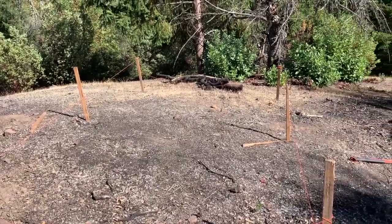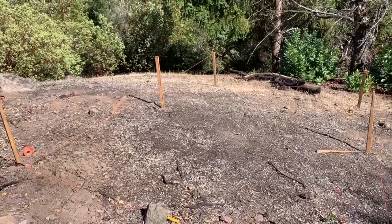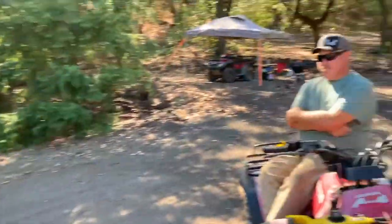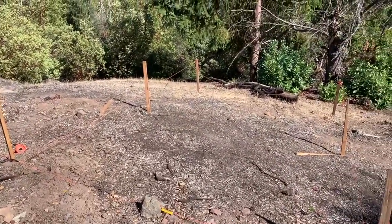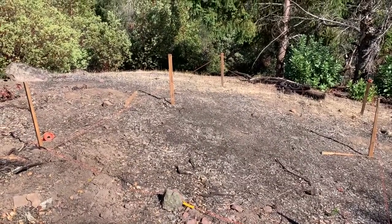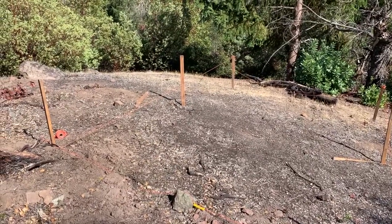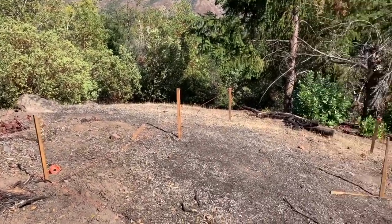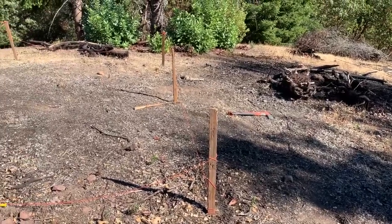We squared everything up and we are within the realm of 12 inch hole margin of error — I'm comfortable with that. Next up is drilling holes. We bought a 12 inch auger bit and we have to go get the one and a half inch galvanized iron pipe that we'll build it out of with the T's, and then we should be able to put a lateral there and a lateral here, and that'll provide the structure to put the solar panels on.